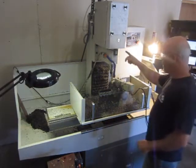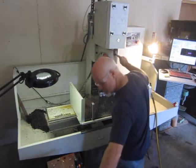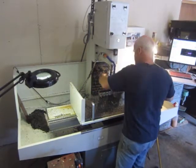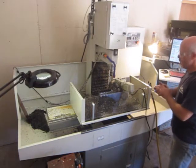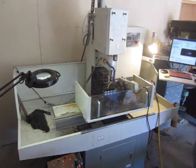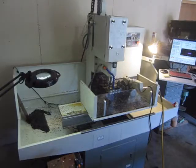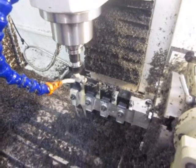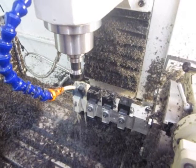It seems like a good time to show off my pneumatic power tool changer. Push of a button, I take out one tool — very important that I put in the right tool after that — and then I hit the cycle start button. This is a one-eighth inch end mill cutting a slot at five-eighths of an inch deep. I'll do that four times.